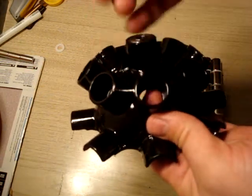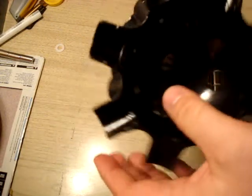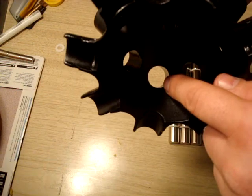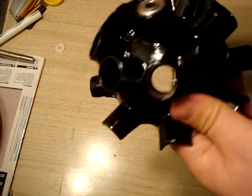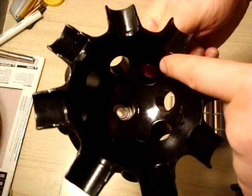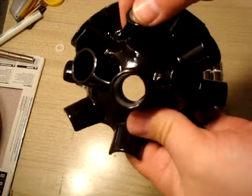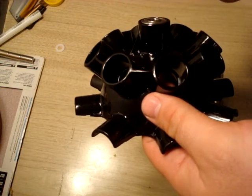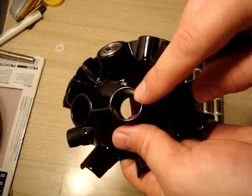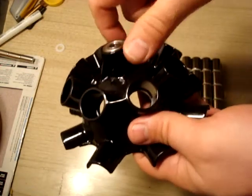Well, knowing that I wasn't going to be able to get the custom magnets that I needed for this in the time that I wanted to do this motor, I actually made this motor a little bit different. This back hole is actually a little bit smaller, so that the magnet itself, which is 3/4, will be pressed directly into this hole. What I'm going to do is press one in so that you can see that. I have to go off camera to do that. Unfortunately, it takes 2 hands to do that, and I'm here alone tonight by myself, so I don't have anybody to operate the camera, so it's on a stack of books so I could do this demonstration. So give me just a second, bear with me while I press this together. Be right back.